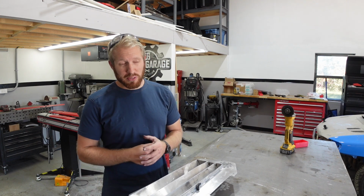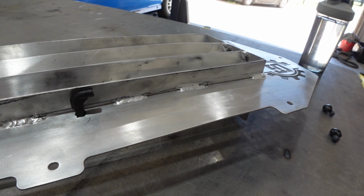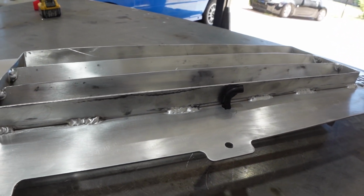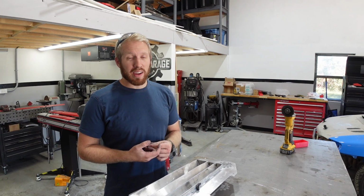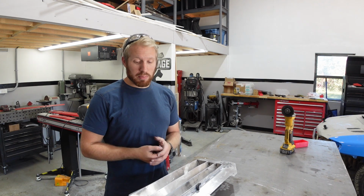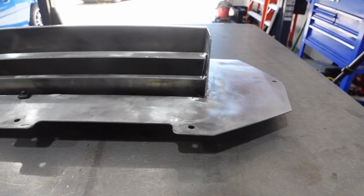The welds, some of them are kind of bad, I'm not gonna lie. Part of that's me not being that good at it and being really out of practice with it. And then I also had the door open. That's my excuse. I get a lot of wind that comes in, and when you're welding without a gas lens, with a number 6 cup, it doesn't work that well when you get a bunch of wind that all of a sudden starts coming in there.